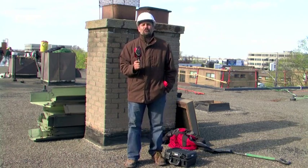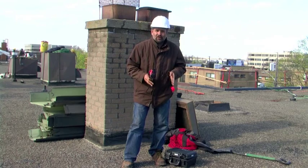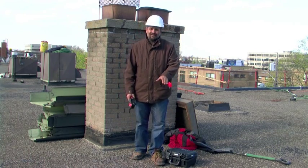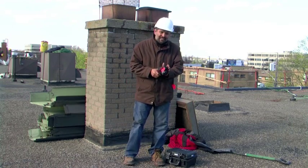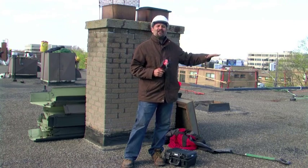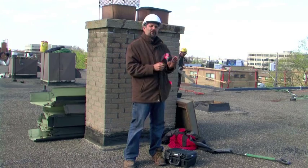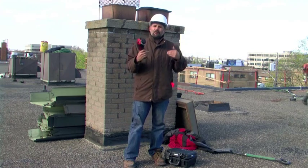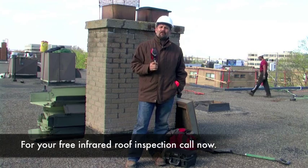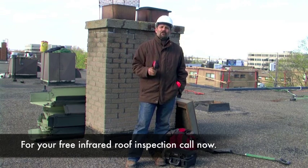These infrared cameras are an excellent tool to find leakage in flat roofing systems. Sometimes inside the building the roof could appear like it's leaking in one location, but the actual damaged area could be 40 feet away — it leaks over there and migrates over the concrete, wood, or steel deck and then leaks in here. With an infrared camera you can see that stream of water underneath the roof system, trace it back to the actual location where it's leaking in, and repair that location. We also use this for resurface roofs — we scan the roof after power washing, do a full roof scan, look for any wet underlying insulation, cut those areas out, and repair them with new dry insulation before we do the resurface. We give a free infrared inspection to anyone who'd like to call and get an infrared inspection on their commercial or industrial property. Give us a call — we'll come out with the infrared camera and see if your roof has any leaks.